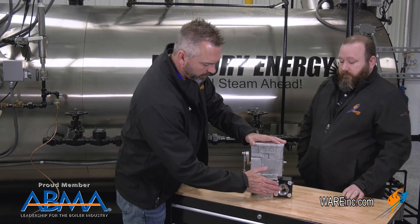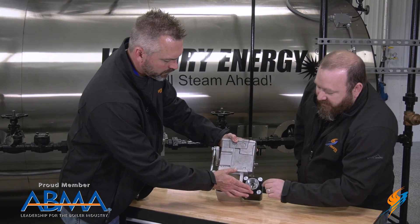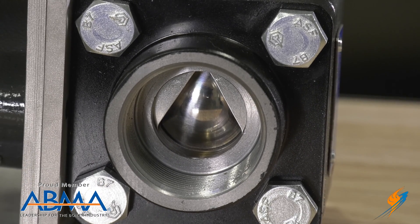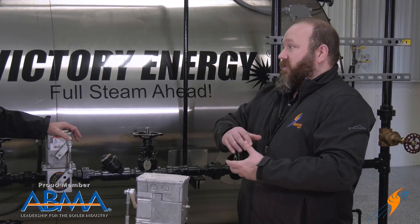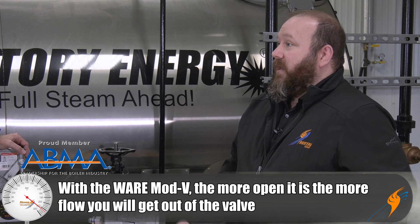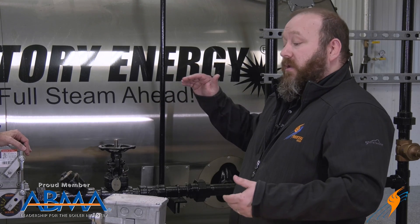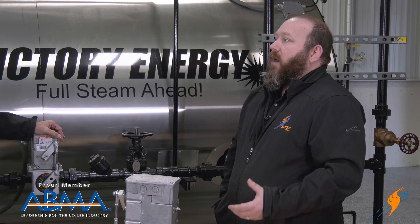What's the deal with the V-port? Why is it that way? The V-port has a notching that's narrow on one end and wide on the other. That's what gives you your character of flow. As your boiler needs more water, it starts to open up toward that bigger end, giving you more flow rate through that bigger orifice in the valve. As you need to turn that flow rate down and keep the water level more steady in the boiler, it starts to tune toward the smaller end. So you get a good, even flow through that characterized operation.